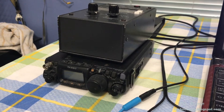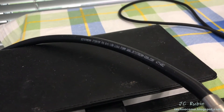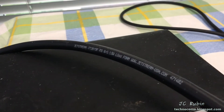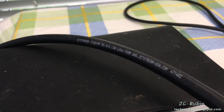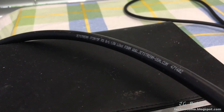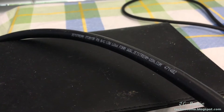Instead, we're going to tune the antenna itself. Second, I use quality cable — this is RG-8, a low-loss RG-8 cable. Obviously very important, though not so extremely critical for HF. Not a big deal, but still something to keep in mind.